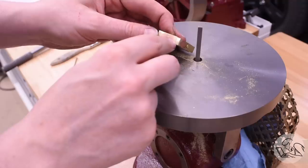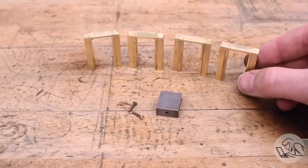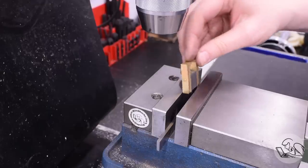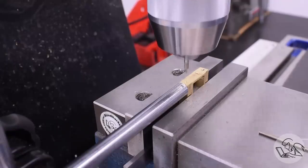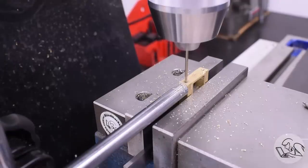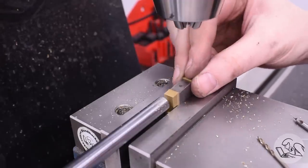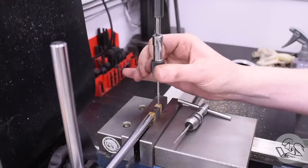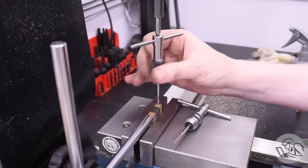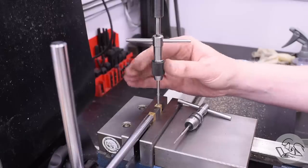These are going to be painted, so I'm not spending too much time on finishing work. Final finishing consisted of filing the fixturing screw heads off the top, filing off the excess length of the cross bars, and filing the T-shaped profile of the columns into the cross bar so it's one continuous shape down the side. Finally we need some threaded holes in the corners of each piece to attach the arch bar truck structure. I'm drilling and tapping through the remains of the little brass fixturing screws — those aren't needed anymore, and these new screws are larger, so we're effectively eliminating them. It's a neat technique I would not have thought of.